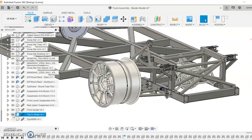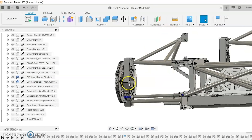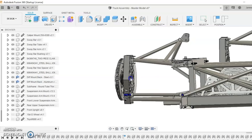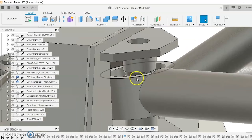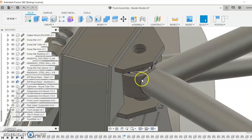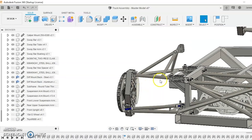Looking at what I have here — if I hide this 18-by-12 wheel, which I did actually design, and come over this way — I can grab onto the whole suspension assembly and move it up and down through its whole cycle. Things I can look for here are interferences between tiny components. You can see there are some spacers here, this is a spherical bearing, and it all moves around. It blows me away what CAD can do if you really get involved in this stuff.